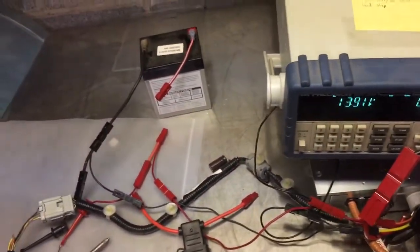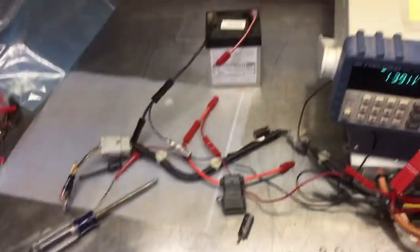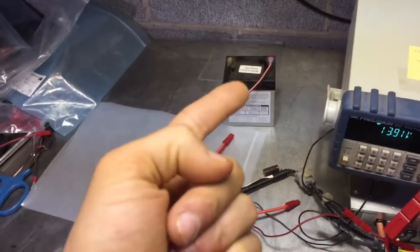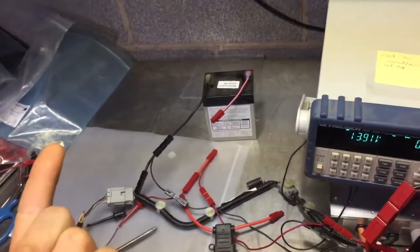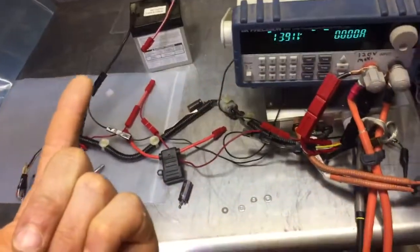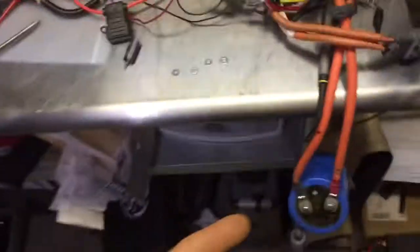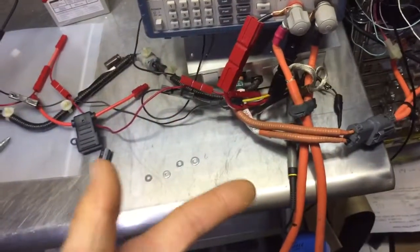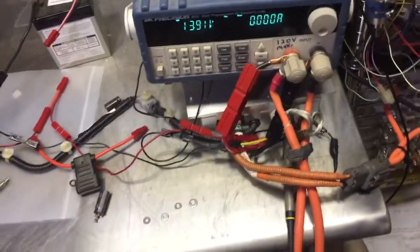So anyway, the point of the story here is, don't run another battery into the back of your car. Don't try and run another lead off this battery, because it can't source that, it can't synthesize that current demand. Get a capacitor, install it right at your DC-DC, which is also where you should install your amplifier if you have a sub amp.